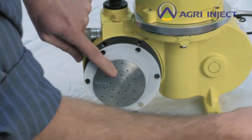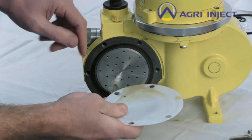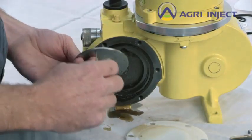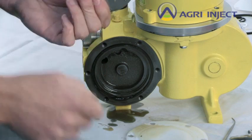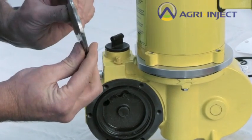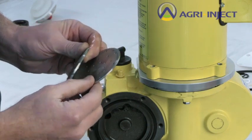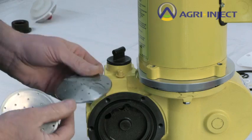The head will have contour plates on each side of your diaphragm. These contour plates have a curve. Both plates should curve away from each other in the middle. This allows your diaphragm to flex back and forth between the two plates. Make sure you have the contour plates in the correct orientation as you go back together.